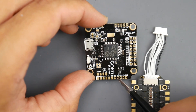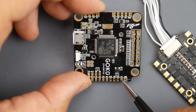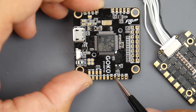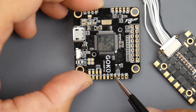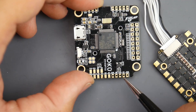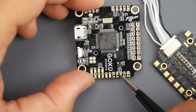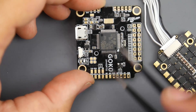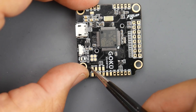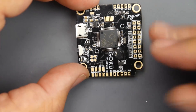The leftover pads are for LEDs and buzzers. To install a buzzer, connect 5V here and the negative of the buzzer to the buzzer ground pad — not regular ground, because that pad is what initializes the buzzer. For RGB LEDs, you have ground for the black wire, then 5V, and then the LED signal pad, which outputs the digital information telling the LEDs what color to display. Also, some ESCs have telemetry — especially BLHeli_32 — and you'd put that on R6, not T6. We also have motor 5 and motor 6 pads here as extras that you can remap to something else.